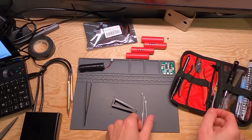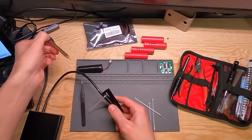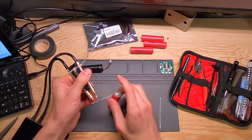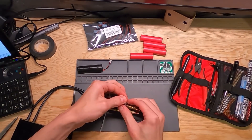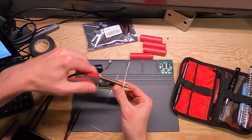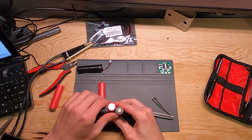First things first, I modified my spot welder. I was tired of using the probes like chopsticks or needing a third hand, so I 3D printed a little bracket — files are linked in the description — which holds the probes on with zip ties, keeps the tips at the perfect distance, and now you have one easy-to-use probe. This spot welder automatically detects when both probes are touching the workpiece and applies power after a short delay — no foot switch needed. I'm also concerned that touching the two probes together without a nickel strip in between could cause problems, which is another reason I made this mod.